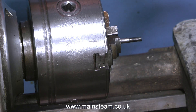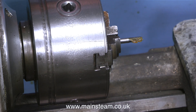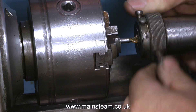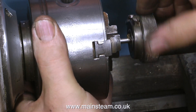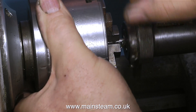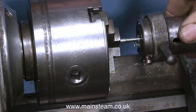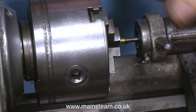The only way out of it is to frequently withdraw the die and thoroughly clean it — get rid of all the swarf in the holes, then put some more lubricant on and go back in again to cut the rest of the thread. This is 3/16ths of an inch diameter stainless steel, and the best way of cutting successful threads over a longer distance like 3/4 of an inch is to do it a quarter of an inch at a time. After every quarter of an inch, withdraw the die, thoroughly clean it, then apply more lubrication to the existing thread and run the die down another quarter of an inch.